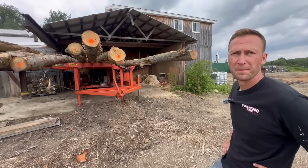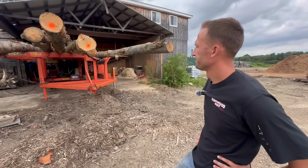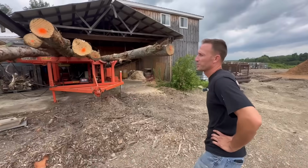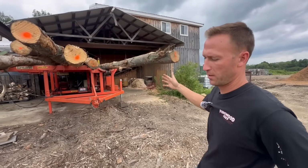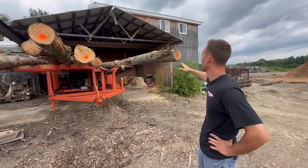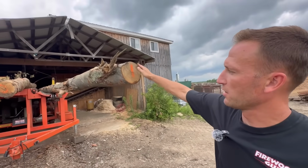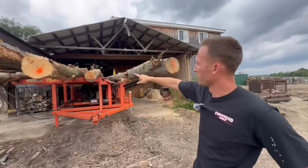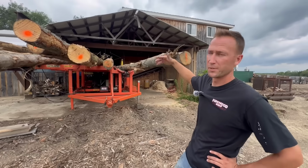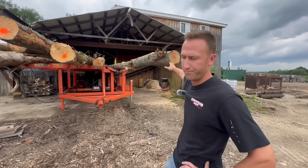So you've got a pretty beefy firewood processor here. How is this new log splitter going to improve your process from what you already have? Yeah, so we do a lot of fireplace wood. Most of our customers are burning for enjoyment, not for heat. We do sell a lot of heating wood, but predominantly cooking wood. So even a piece of wood this size would go through our 6-way, one stroke and be done. But some of these bigger ones, we're all looking at the small ends here, but on the other end, there'll be 3 or 4 sections that'll get recycled back through the splitter to make the size that we're looking for. So push it through the wedge, pull a piece of wood back, push it through the wedge again.